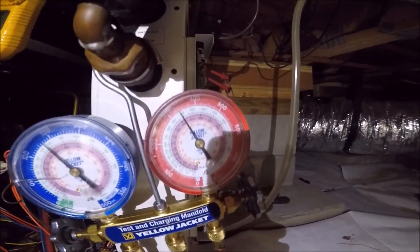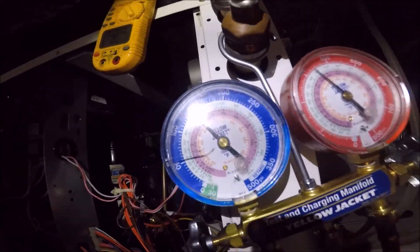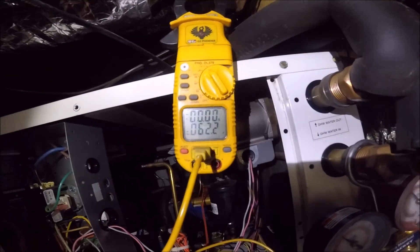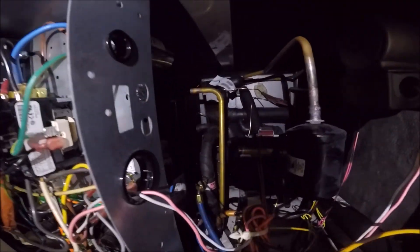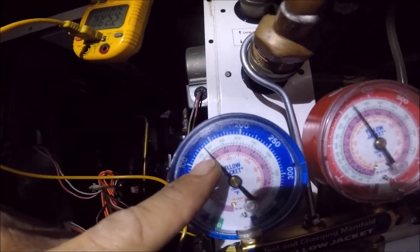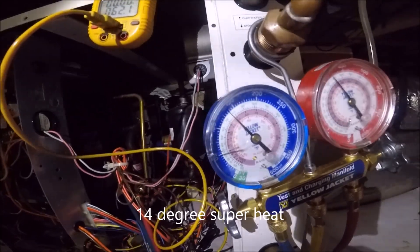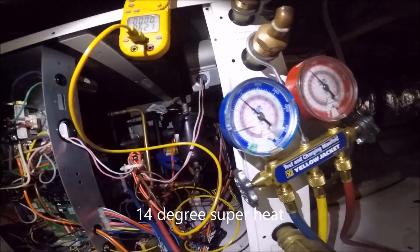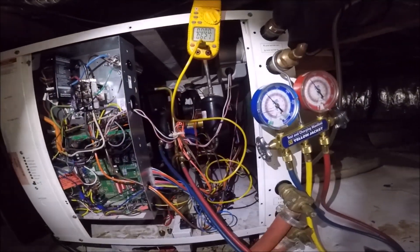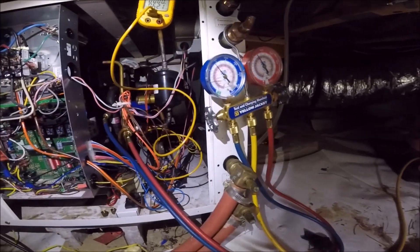All right, hope it all helped you guys. There's our head pressure running at 350, suction pressure 135. Let's check our superheat one more time since it ran a little while. We're looking at 62 degrees, and on our red we're at 48 — that gives us about 11 to 12 degrees superheat. I call that a fix. This is Bill, water furnace tech. Thanks for watching. I hope this helps somebody. See you on the next one.